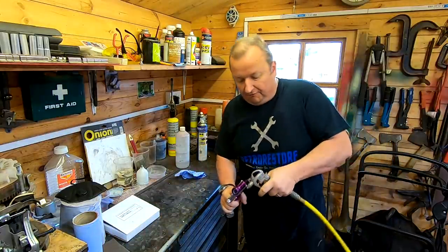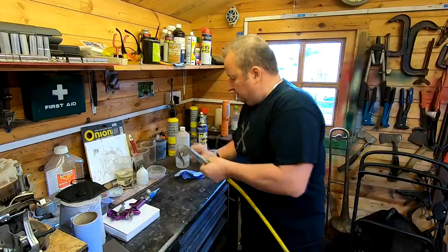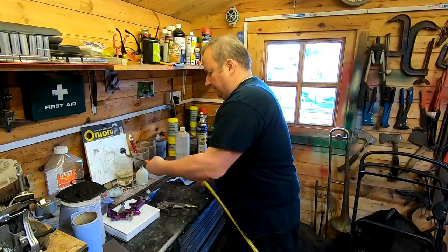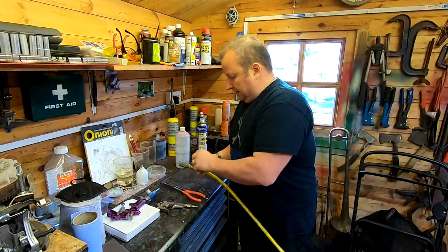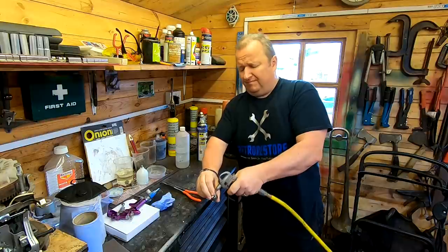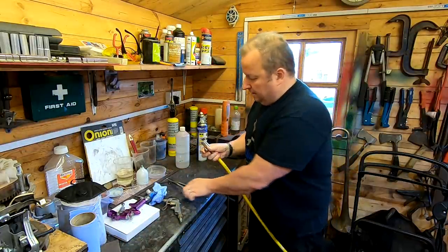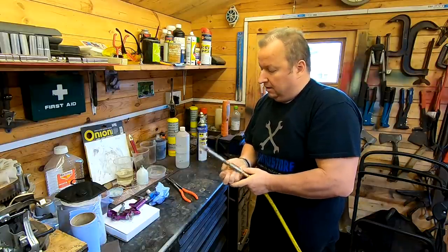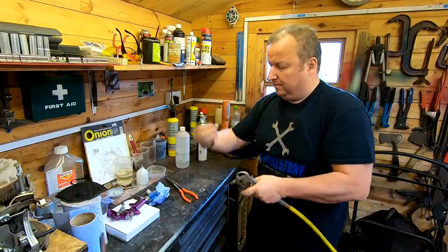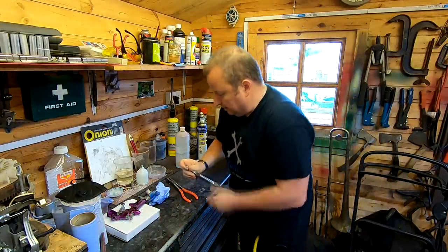Right, just get my airline now and give that a blow through. Simple as that. Needle. Give that a wipe over. That's clean out. Just get the air cap out of there. Again, just give that a quick wipe over. And again, a little blow through with my nozzle. That's all you need for that. Again, should have goggles on really, but make sure that's nice and clean. And when you look through it, shouldn't have any blockages whatsoever. And that basically is as simple as it is to clean the gun out.